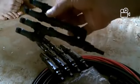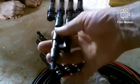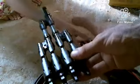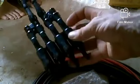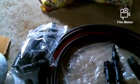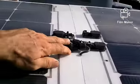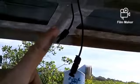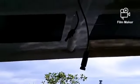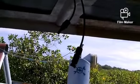These are just a bunch of Y connectors that'll take four parallel things down to one. This is a spaceship. No, it's not a spaceship. It is a pretty cool spaceship though. But this is the same thing with four blocking diodes on them. This is a pretty big piece of stuff. And they also sent me a bunch of connectors, this wire, more connectors. Yesterday I started making wires for these, and I got two here, and I made them short, thinking I can put one of the Y connectors here so they only have two wires going that way instead of four. Just want to look at it before I keep going. I think that's good. Good idea. All right.